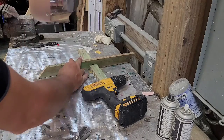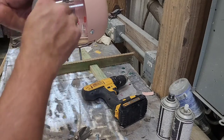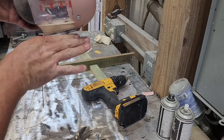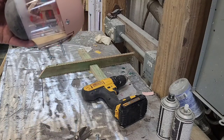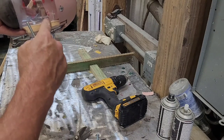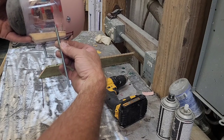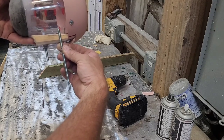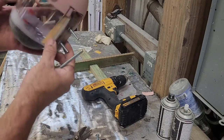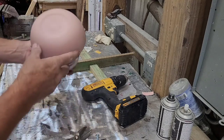Now you can see it's starting to take shape. You've got your cover that's going to have the lines on it, your body, a nice little curve in here, a nice mounting point, and some studs that can go through whatever you're going to mount it off — a flat plate or something like that. If these aren't long enough, you can always take a piece of all-thread, put a nut on there as you put it in to snug it down. That'll give you a longer thread, just in case you're going through a full piece of one-inch, one-and-a-quarter, or one-and-a-half tubing for your rack. The nuts kind of become part of the unit and essentially your mounting portion of it.